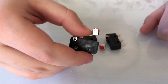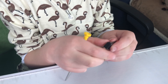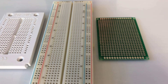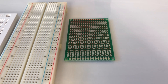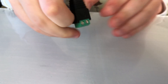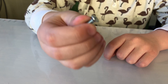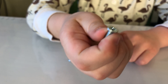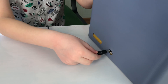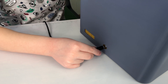We need three standard-size micro switches — these are optional, for changing the schedule, the portion size, and to dispense food immediately. A breadboard or a prototype PCB if you want it soldered, some wires to connect everything together, a plastic female DC connector, four M4 screws with countersunk heads — I use 10mm in length but any would fit. A 5-volt 3-amp power supply; a right-angled version is better. Maybe someday I'll make a side-socket version of the feeder.